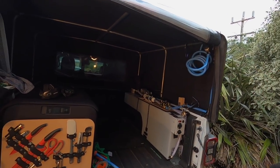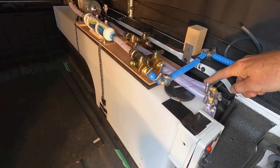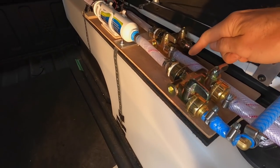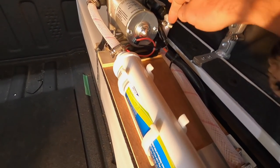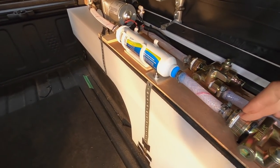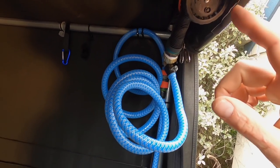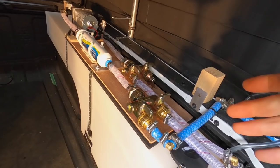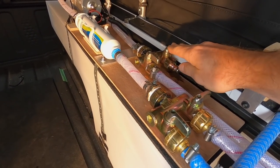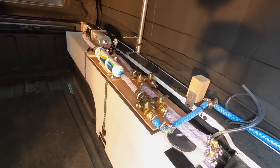Let me give a quick overview while you can still see everything. The hose goes down into the tank, comes into one of my splitters — which is turned on so we're suctioning from the tank. It goes through a little inline basket filter, through the pump, back through the carbon filter. Then we choose where the water comes out. Right now it's coming out through the blue hose, which routes up and along to the springy hose and out the spray nozzle. The two taps on this side dictate input — where the water is coming from — and the two on the other side dictate output — where it goes when you flip the switch.